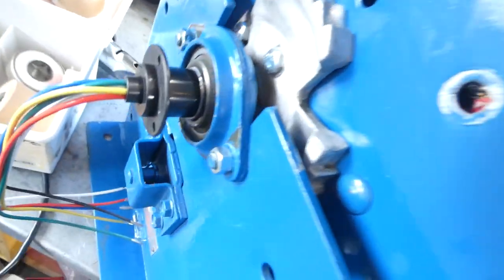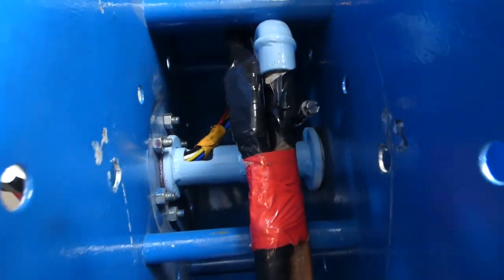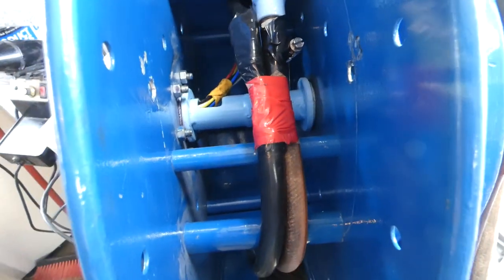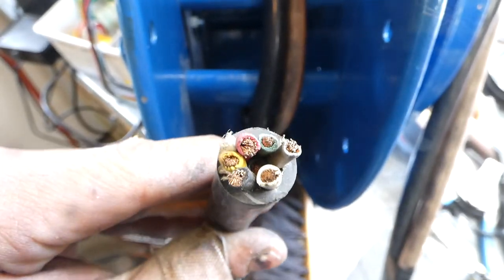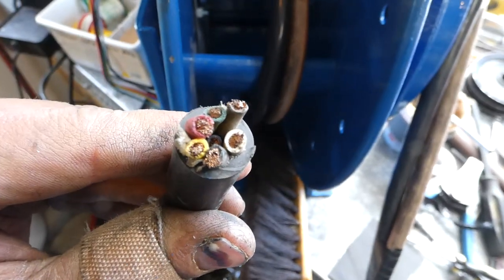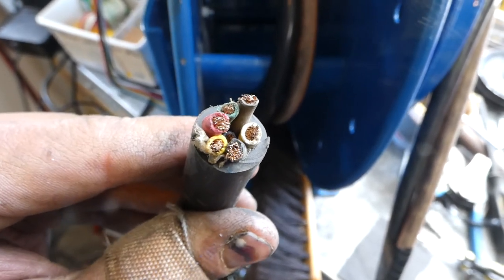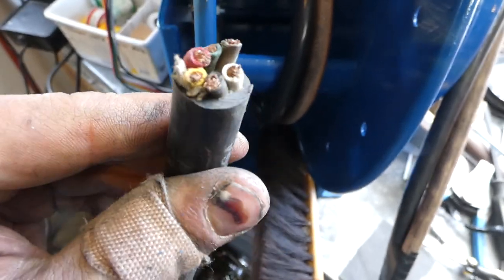Here's how that slip ring fits up — just a press fit with some Loctite, then the wires come out of there. They're soldered onto the wires in this SO cord, heat shrunk, electrical tape, friction tape, everything — the works. Here's a look at what this cable looks like — kind of funky stuff. Seven conductors in one SO cord: six 12 gauge wires and a ground. With this number of wires I can carry two 220 circuits for my inverter welders and a 110 line as well.